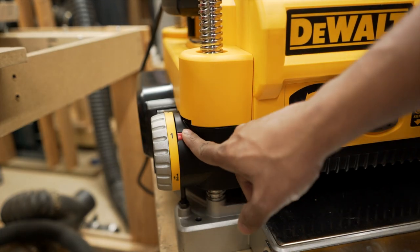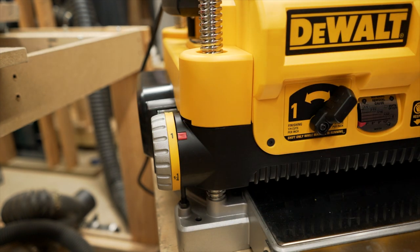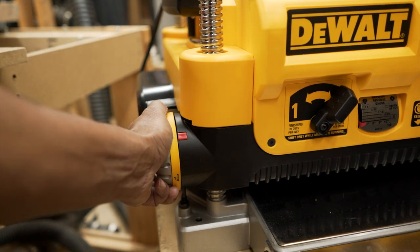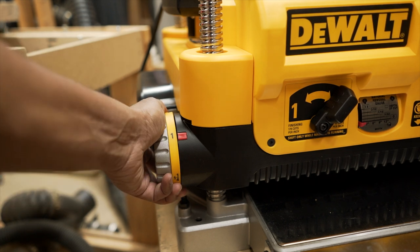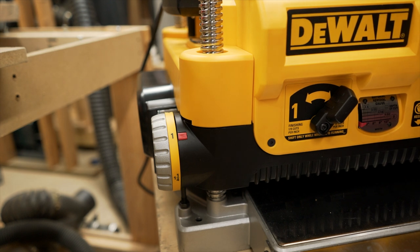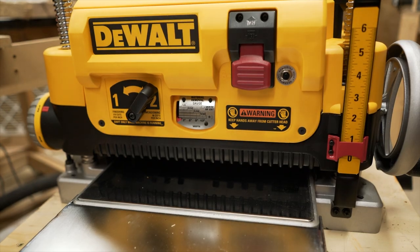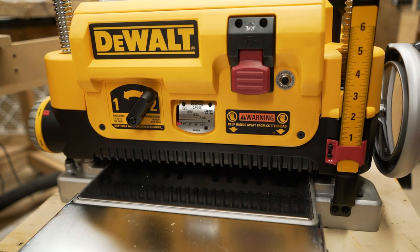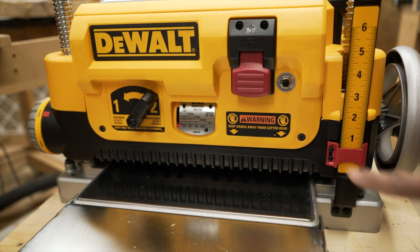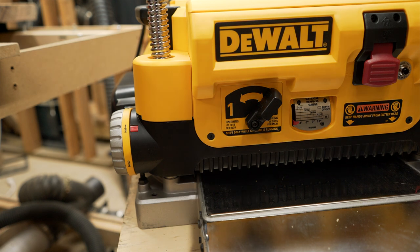A quick note about the turret system. By default my planer came with the one-inch turret set, meaning I couldn't lower the housing below one inch. While it was at one inch I was trying to move it to allow for three-quarters inch, but it doesn't allow that. If you hit a turret lock or turret stop, you need to raise it back up and then lower it to three-quarters or half inch. With the turret setting changed you can go lower — down to half inch. Again, while it's in the turret lock position you can't change the adjustment; you need to raise it up a little first. I guess it's part of the learning curve.